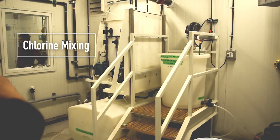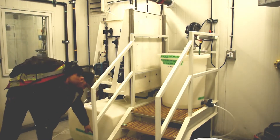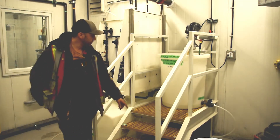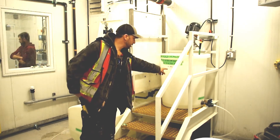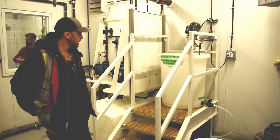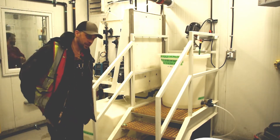In storage, there's a point where we've labeled 'add' when it gets to here. We also have a 140-liter mark on the tank itself, and we have instructions which read: add 10 cups to 140 liters, mix 30 minutes, let it sit for 24 hours, and then drain into the dosing tank.